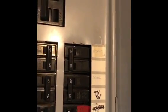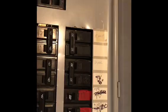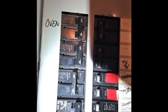While I'm down here, I'll go ahead and show you the breaker box. So they've got two panels. The panel on the left here is going to be for what we're looking at, and you can see there's one 40 amp breaker that's turned off. I'm assuming that's the 40 amp breaker for the outdoor condenser. There's a 30 amp breaker up there on the top that says AC unit, but there are two systems in this home, one upstairs, one downstairs. So this 40 amp breaker right here, I believe, is the only one that we're going to be dealing with. And then as far as the model, it's a Challenger series panel box. That should be it.